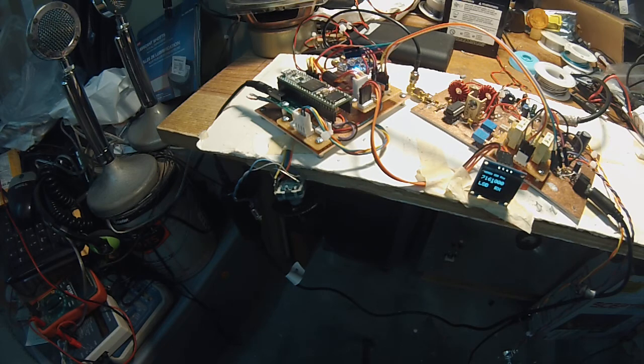I'm going to replace that with some small insulated cable, or I should say shielded cable. By the way, for shielded cable, I use some cable out of some earbuds that are defunct, and that makes it very, very good. If you're very careful soldering the leads, you can get the shielded aspect out of the former cable that went to the earbuds. So anyway, this is much improved.